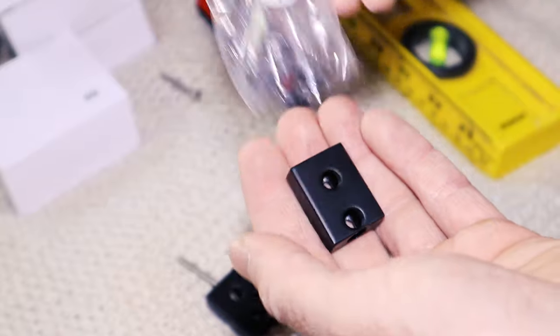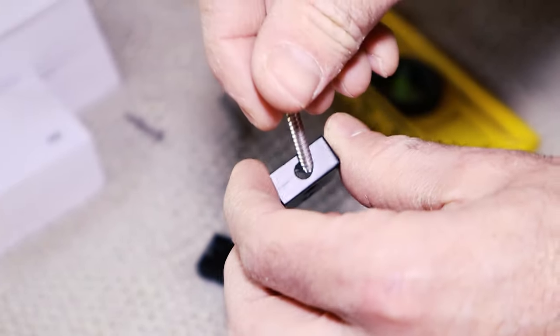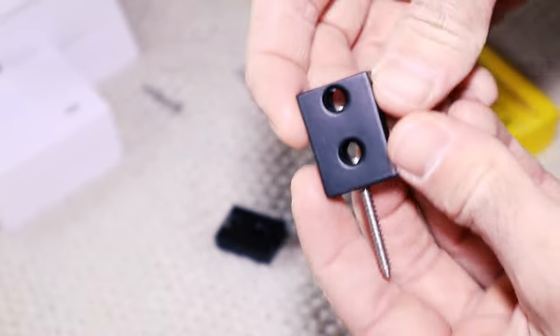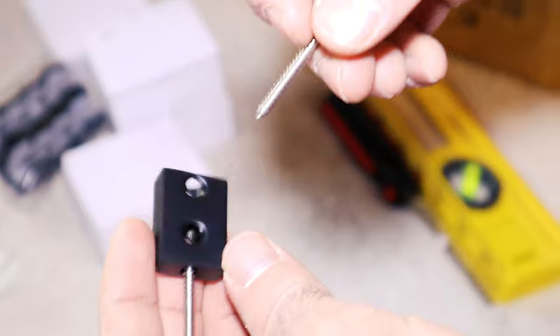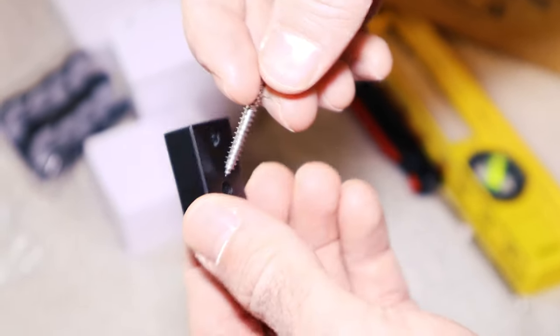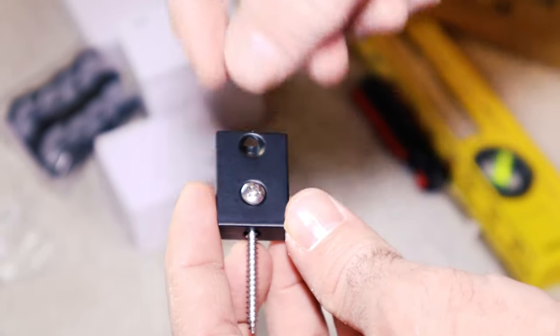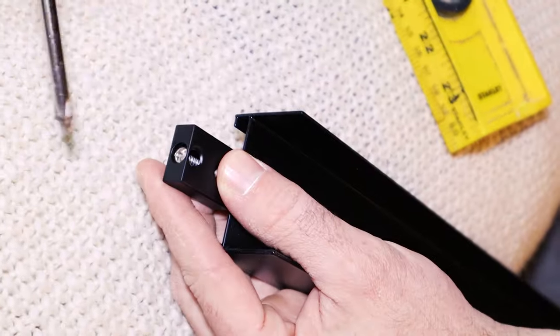This little bracket goes up the side wall rails — make note of which way the screw is inserted. It needs to go through the larger holes so the head of the screw goes all the way into the inside of this bracket. Then look at the face of the bracket and look at which side has the beveled holes. This will be the side you want facing towards your shower because it will fit a screw head flushly. The other side should be flush with your tile wall. Then you just want to screw this bracket onto the top of your wall rail.